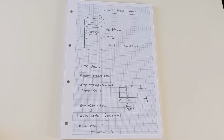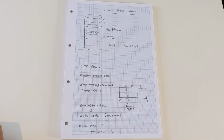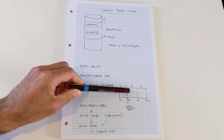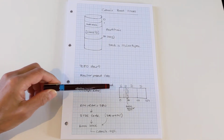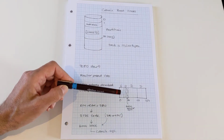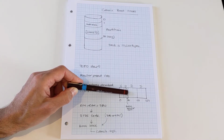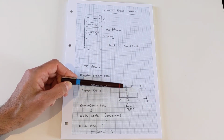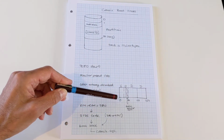So they placed a different constraint on memory manufacturers, was please make a memory card into which you've got this bank select. So you could have a 64K memory card which could, say, be split up into a number of banks. Let's say it's two 32K banks, and on power on, the first 32K of memory is available, but the rest of the 32K memory is not available. So in the old days, you'd only have a 64K card. I'm showing you an example 256K card.